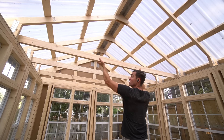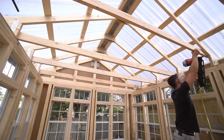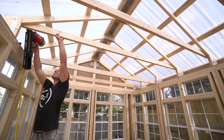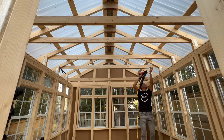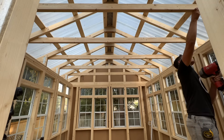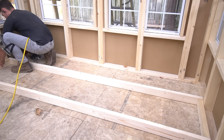With the roof vent installed, we proceed to going inside the greenhouse. The one part of framing we haven't done yet are the cross braces. These cross braces are connected at every single roof rafter, and this is because this unit is such a large unit. Some of the smaller units don't require this, but on the larger ones like this 10 by 12 unit, you want to have some type of cross dimensional bracing. With a clamp and my framing nailer, I'm easily able to install each one within a few moments.